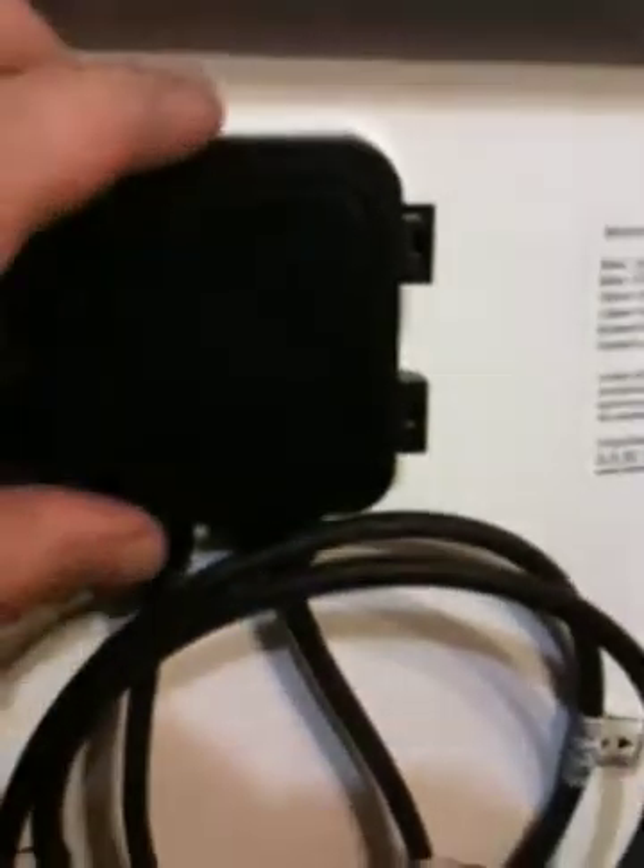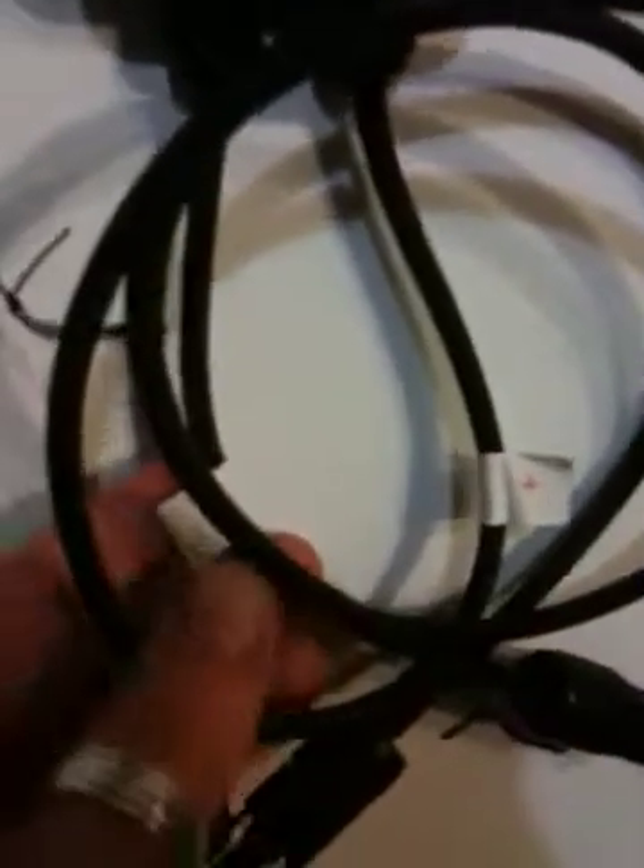Not too big but it's a start. You can see the specs here — it's got a nice bead of silicone around it and a nice little junction box. I think these are called MC4 connectors, labeled positive and negative which is nice. Maximum system voltage is 1000 volts — not sure what that means. Maximum power is 40 watts, 2.4 amps short circuit current, open circuit voltage 22.3 volts, rated current 2.2 amps, rated voltage 18.2 volts.